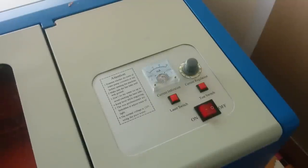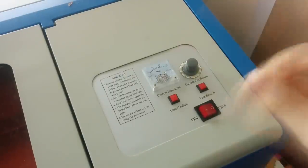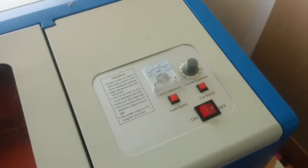Just having a quick look at the front panel - you've got a current indicator from zero to 30 milliamps. When the laser is firing you'll see it jumping up and down. This knob here is the current regulation, so if you're cutting plywood you'll set it up higher, if you're cutting acrylic you can set your beam current that way. One thing it didn't come with was a dial marker around the knob so I could know where the dial was. So I made that in Inkscape, printed it out and cut it around the dial. Now I can record that to cut plywood it has to be at 60% power at five millimeters per second cut speed.